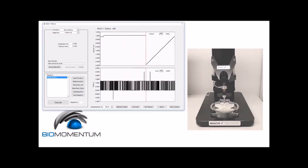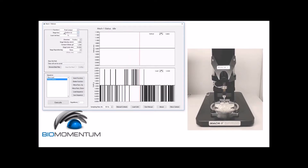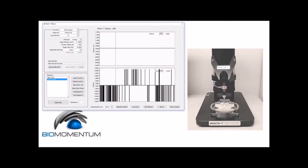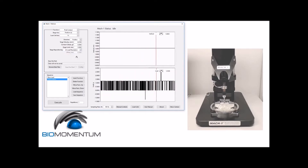The test sequence consists of: a zero load, followed by a fine contact with position Z as the stage axis, the force in the Z-direction as the load cell axis, using a positive direction at a velocity of 0.01 millimeter per second, a contact criteria of five gram force, a stage limit of three millimeters, and a stage repositioning of two times the load cell resolution. Now let's execute the sequence.